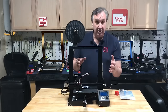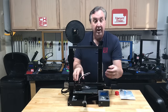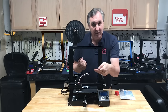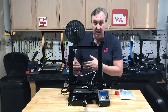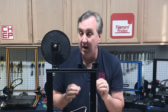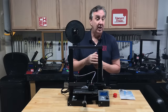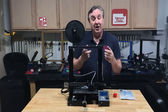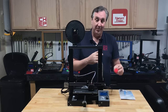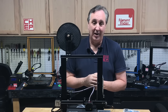Once auto home is done, if you want to move it the motors are powered, so you can shut it off or go to disable under the prepare menu. After you shut it off, adjust the nozzle so it's just above each adjustment knob, then take a piece of paper, slide it underneath, and adjust each knob until the paper just barely rubs against the nozzle. I have a full video showing how to properly level your bed — I'll link to it at the end. I also have videos on using the Cura slicer with Cura profiles linked in the description. I hope this helps you get your Ender 3 assembled properly so you'll have success 3D printing right out of the box.